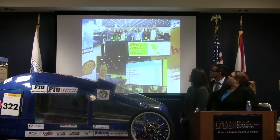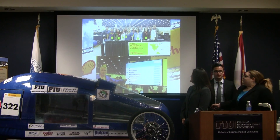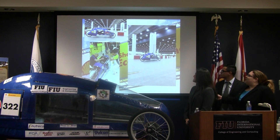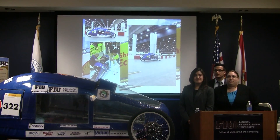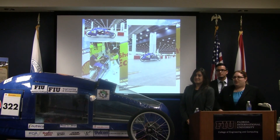These are photos of the group when we arrived, as well as our group advisor Andre Stremante, pointing out that we finished technical inspection. These are photos of the car — for example, a test they do on the seatbelt to make sure it can withstand 1.5 times the driver's weight. They essentially lifted our vehicle from the driver's seatbelt — not very comfortable.